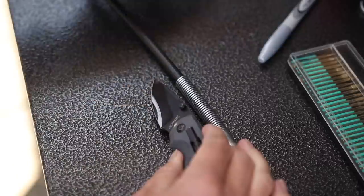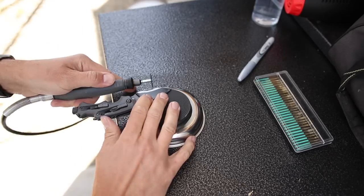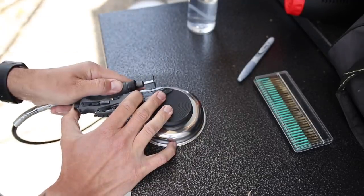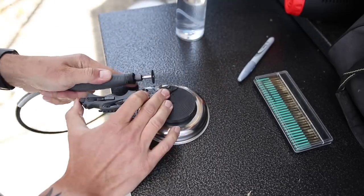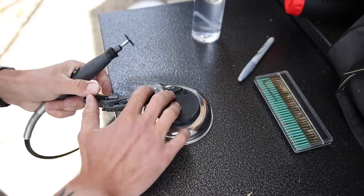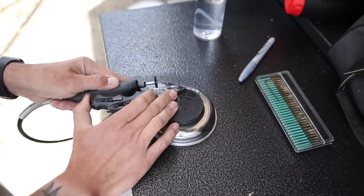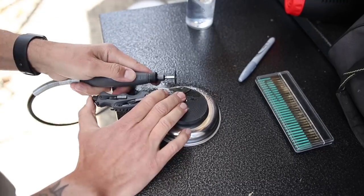To get rid of this material I'm going to use the cutting wheel, doing one pass at a time and spraying cold water on it to keep it nice and cool. I forgot to mention — I'm using the rotary tool on the lowest speed setting, which helps control the temperature of the blade and make sure it's not too hot to handle, so we don't ruin the temper. A quick tip: as you're spraying water, if you start to see steam coming up, that means the water has hit its boiling point — at least 212 degrees. We want to keep this under 300 to 400 degrees, so once you see steam, stop and spray more cold water. The less steam you see, the better.